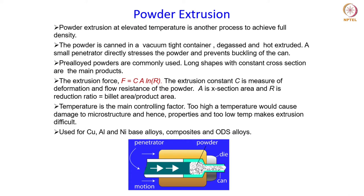If you remember, we talked about powder extrusion during the discussion about the shaping operation, but in that case it was done just to shape the powder using a slurry — there was no heat involved, it was simply to compact the powder into a particular shape. But here we are talking about densification with simultaneous application of heat and pressure, so the powder extrusion process we are discussing now is done at high temperatures.